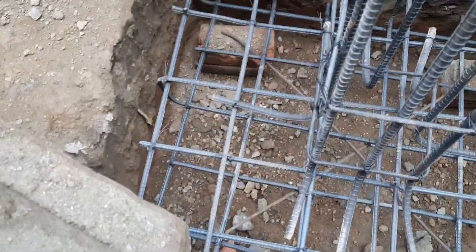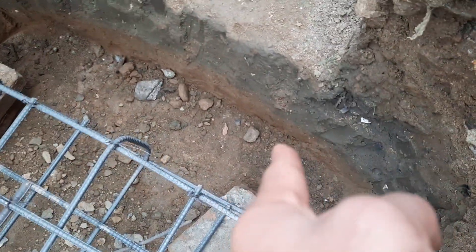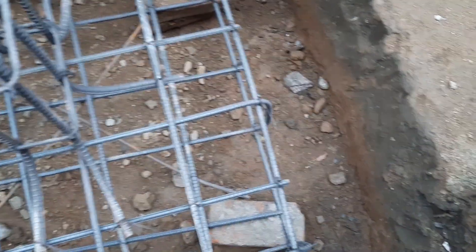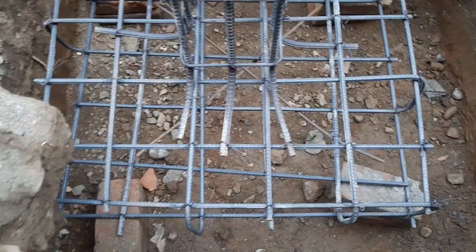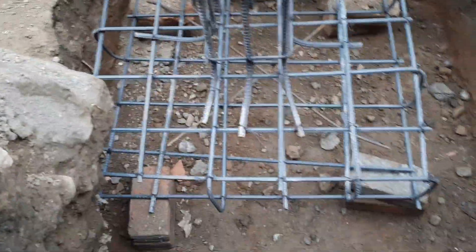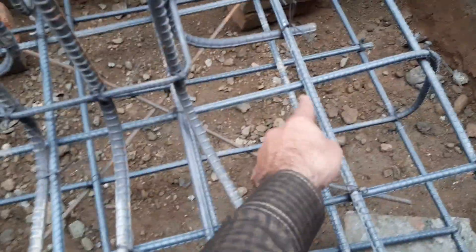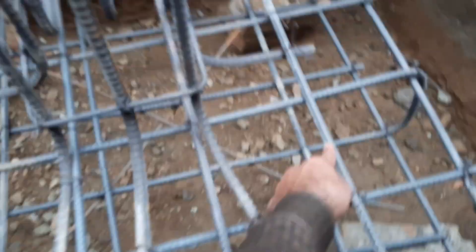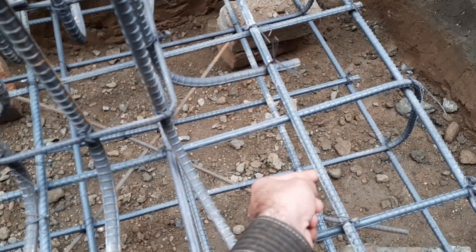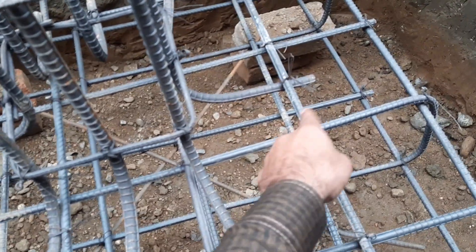You can see the spacing of steel reinforcement is six by six inches. The concrete cover is about six inches on each side, which is not the perfect design because they didn't follow any structural steel drawing for this footing. The bar diameter is 12mm, spacing is six by six inches, and the column is placed at the center of this footing.